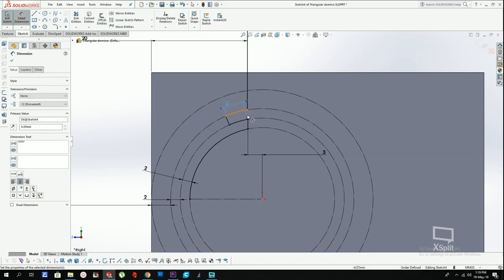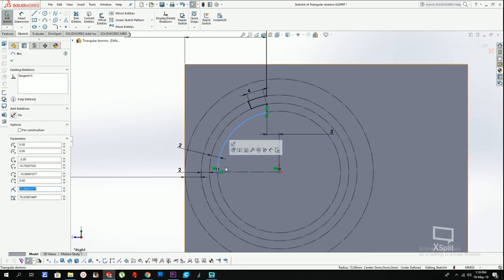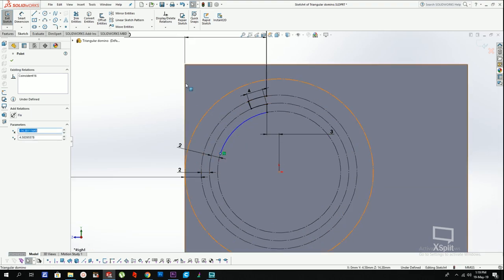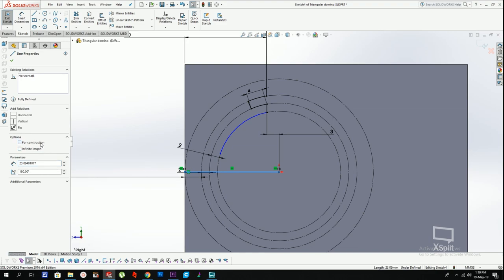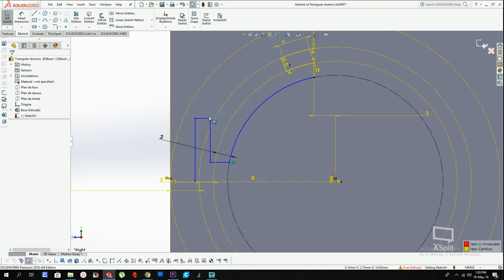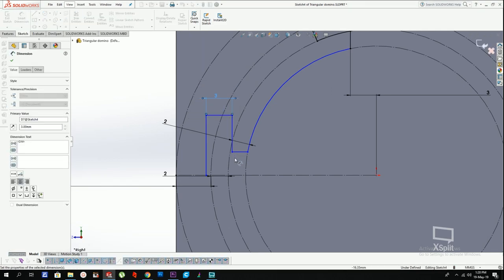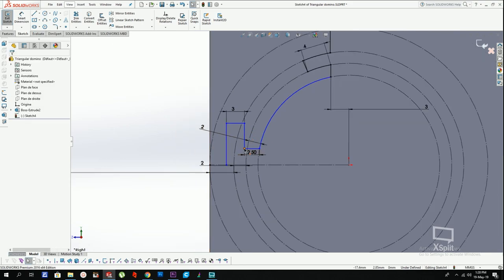This is the axis of rotation of the puzzle. I need to make sure this is large enough for a screw, so I'm going to put three millimeters. As you can see, this hook is way too small, so I'm going to make it longer — I can choose to make it as long as I want, thanks to the V-mechanism. I'm going to make it four millimeters. I don't trust FDM enough to put less, so let's do four millimeters. There's something the CAD design didn't understand — sometimes it's over-constrained, so the software doesn't know what to prioritize.